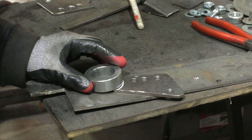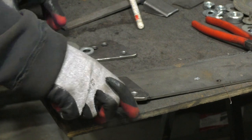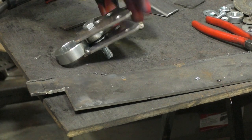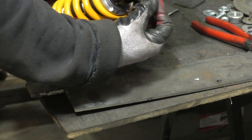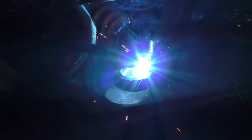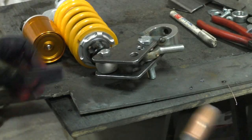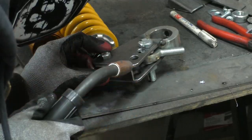After that I got to welding the bearing race at the bottom of the cantilever. This design is slightly different from the one I used on the front suspension — the wheel spring rate is going to be the same, but because the suspension geometry is slightly different front and rear, I had to change the cantilever design to achieve close to the same wheel spring rate at both ends. I also added an extra support on top of the cantilever to make it stronger.